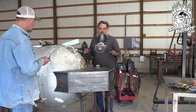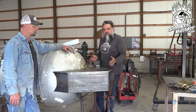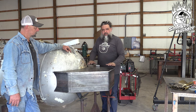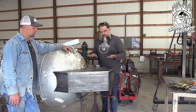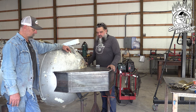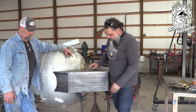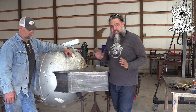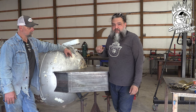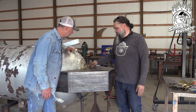Fabrication is all about making decisions on what to deal with on hand. We have a lot of material here and we can constantly make little changes and take material away until the gap is perfect. One of the things we're weighing is the plane of this — our gap is to the point now where if we just raise or lower this a quarter inch, it would take care of a lot of our cope and line things up much nicer and cleaner. We found the center and pulled the measurement from the ground. Ultimately you want this right in the center of your cooking grate, so the theory is it draws evenly over the manifold and collects right at the grill grate. If we're a quarter inch up or down, it doesn't matter. And if that saves us an hour of coping, then let's do it.